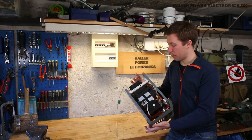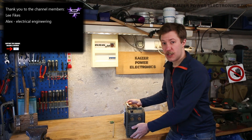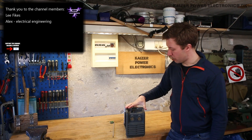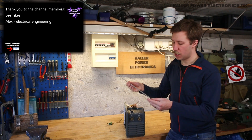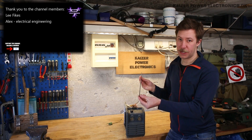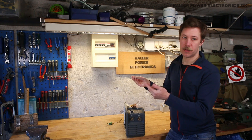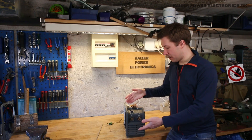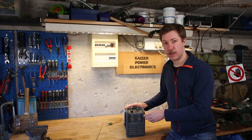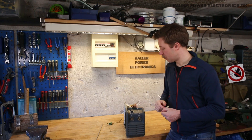This is a small portable unit made by the Danish company Megatronic. It is a shielded metal arc welding machine, which means it uses stick welding rods with a layer of flux on the outside and the filler metal on the inside. So it's rather basic — you have a ground and a plus for your stick welding, and you just make an arc and weld metal together.